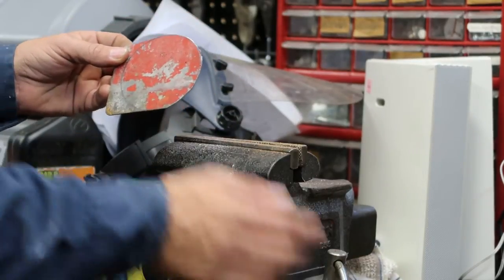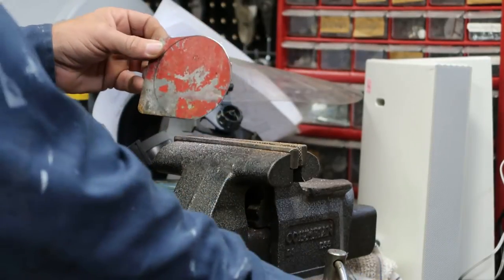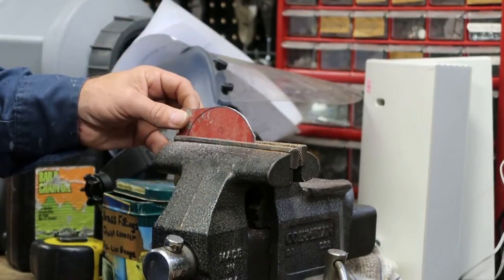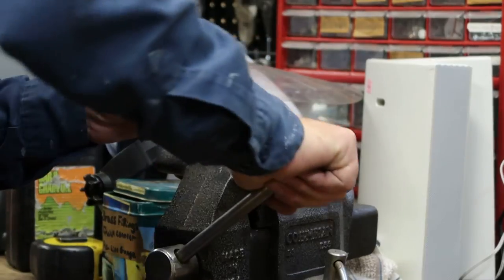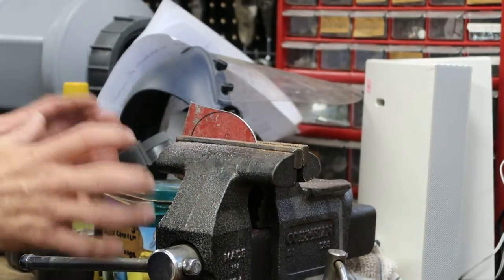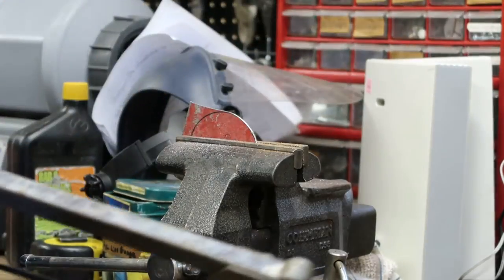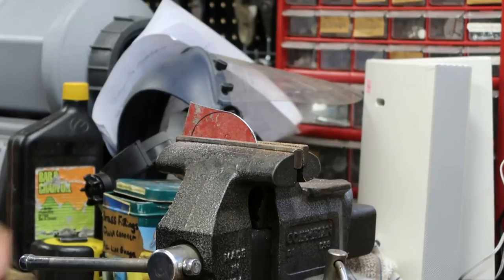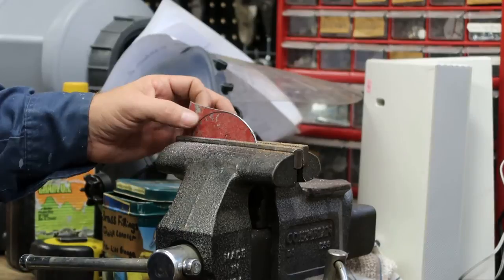I'm cutting it out — it's not perfect — and then I'm going to take the file and file around it. These two files come in handy when I get into a corner; I use them to get the angle on the blade correct so I can saw a little bit more. You've got to make damn sure your vise is pretty stout and well connected to your bench because it's going to move around with you. I'll give you a short demonstration and then shut the camera off, because it'll take forever otherwise. But this is pretty damn thick sheet metal.